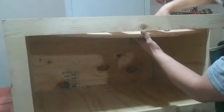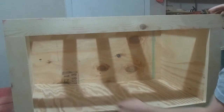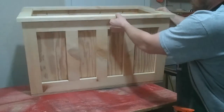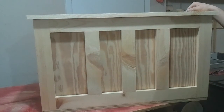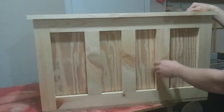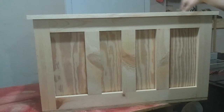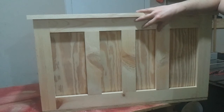So the inside — two side panels go in first, then the front and back end second. What I'm going to do in the meantime while I wait is take the panels out, sand both sides of the panels real good, and sand the rest of the box real good. The entire inside panels and base is going to be painted white and get a coat of lacquer on top of it.